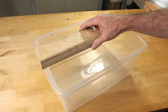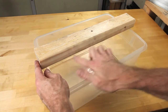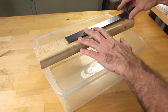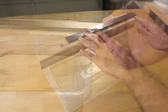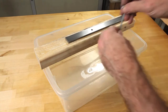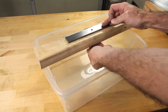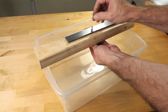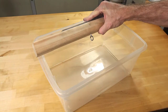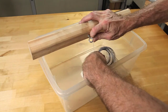You're going to need a non-conductive support to span the tank. On top of the board, I place a bar that overhangs the edge just a little. This bar has a hole that matches the hole in the board. We're going to put an eye bolt through the board and the bar. This serves both as a support for your part as well as a conduit for the electricity to reach the part. We'll use a steel wire to connect from the eye bolt to the part that you're going to be cleaning.